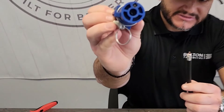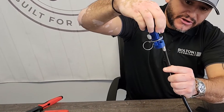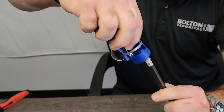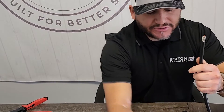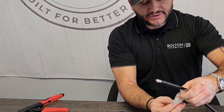The last step is also with the grooving. On the inside of the LMR 400 prep tool there's a groove, and you're going to apply this groove onto the center conductor and do a twist back and forth. What that does is cut the center conductor and prep it for connectivity for the center conductor pin that goes over the LMR 400 center conductor.